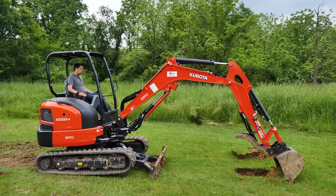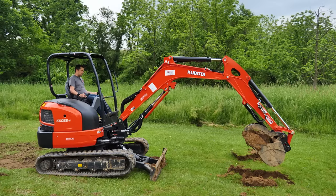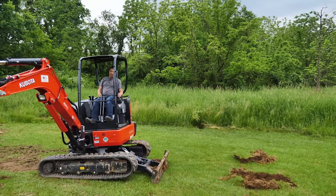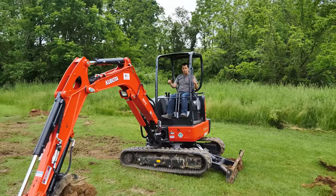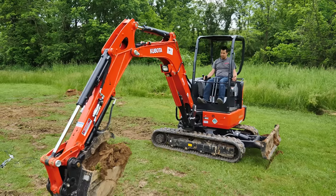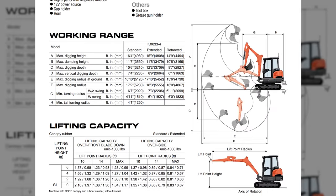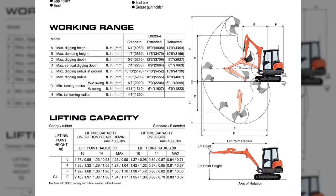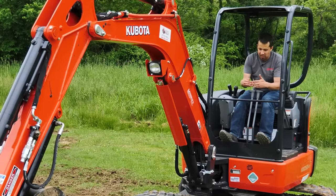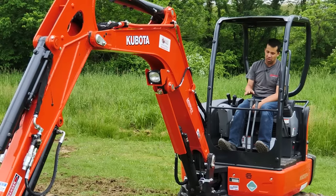You do want to watch — if you're out here working and you get a bucket full of soils like I have here, I've got it nice and far away from myself. As I swing the machine to the side now, I'm taking that same weight and I'm going over the side of the machine. Now I have that same load out over top of the side of the tracks. You can run into that same stability concern except over this side it's even worse. When you look at an excavator spec sheet and you dig into some of the more detailed numbers, you'll find capacity measurements in all sorts of positions. The one over the side here is one of the worst, because of where that tip point is. The tracks being that close to the house of the machine brings that tip point back, so you have the least amount of digging stability out over the side.